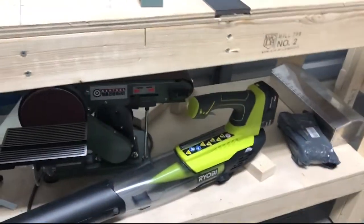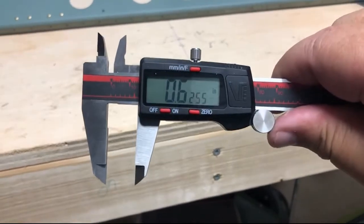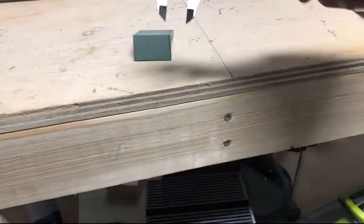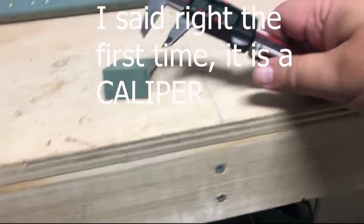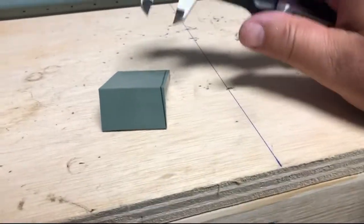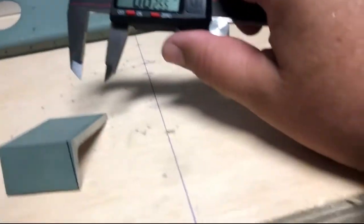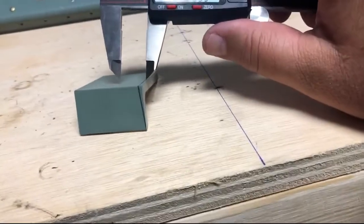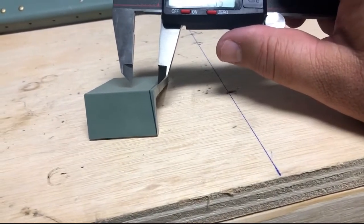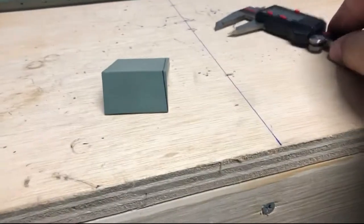So when you're trying to set your dimensions, you can now use your micrometer and set them in the scratch and do your lines. And so that will help you do it. Normally in the machining business, like I said, we use a thing called Dykem, but this is still wet, so I don't want to do it. So you set it to 2.5, it's off just by 0.0005, but you just set it, and then you just take this along your edge, and scribe your mark. I'll show you what that looks like in a little bit, but I just wanted to show you.